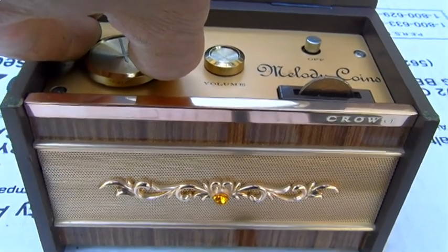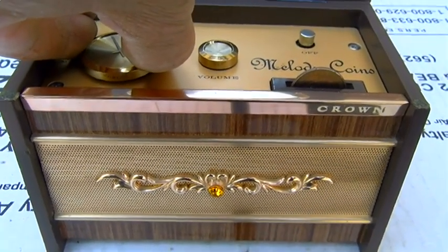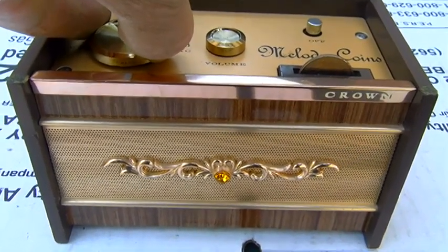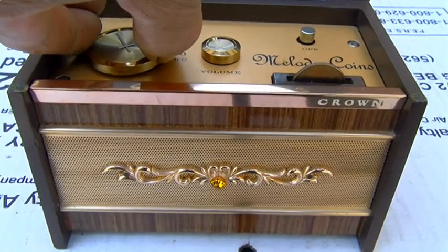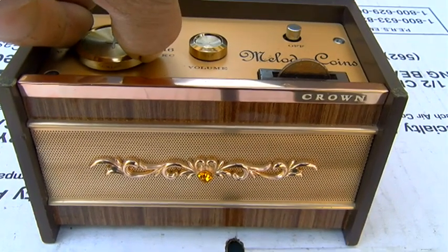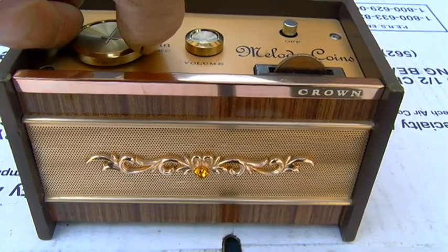As I've covered before, this is usually bad capacitors — specifically a bad AVC filter capacitor. The AVC filter capacitor basically rectifies the voltage coming off the detector, takes all the audio off of it, cleans it up, and feeds it back into the IF to regulate the gain. If that capacitor is bad, you basically get a big oscillator like this because it's not taking the AC off the output.